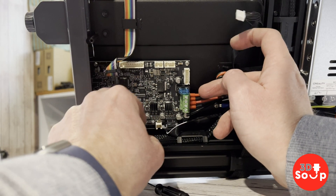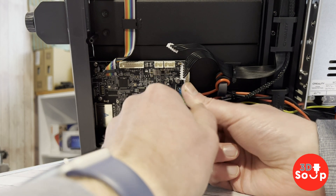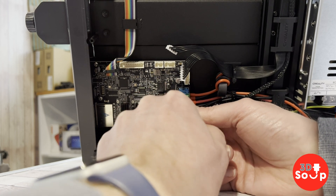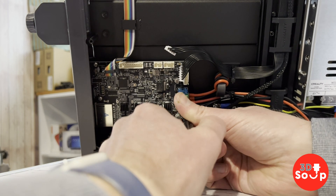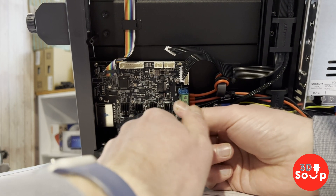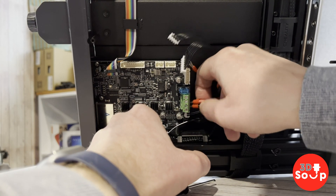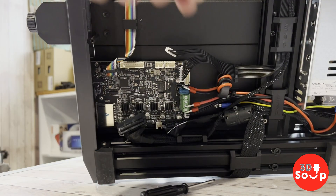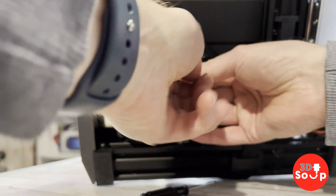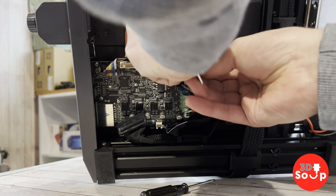That's pretty much most of the main cables — just two more to do. These ones here are the power cables for the hot end and the heat bed. Take these out very carefully — just unscrew each of the silver screws in the green plastic housing, and the plugs along the side will just pull out. There's no soldering here; these are all held in place by those little silver screws. Make sure you know exactly where these go before you take them out. The top two have a washer wrapped around them; the bottom two don't. The red goes on top and the black goes on the bottom of each pair.